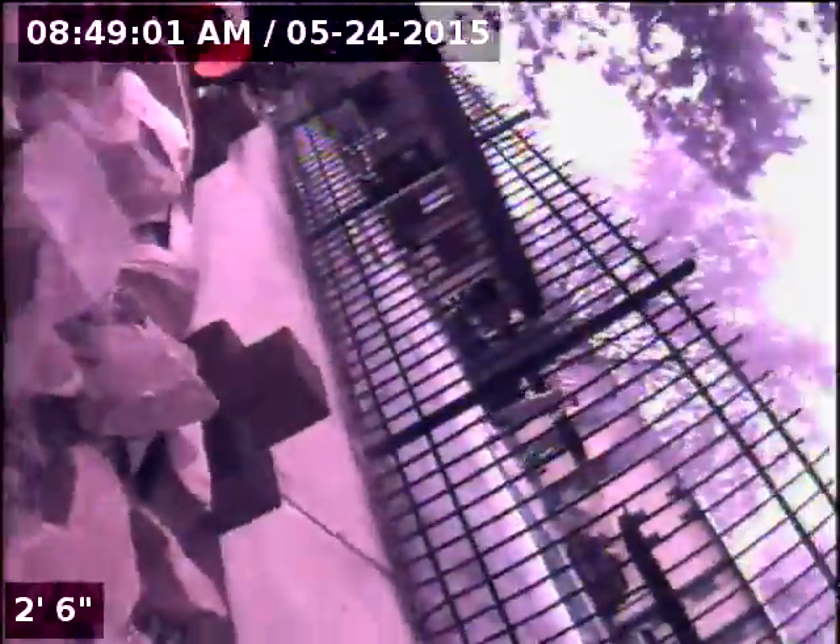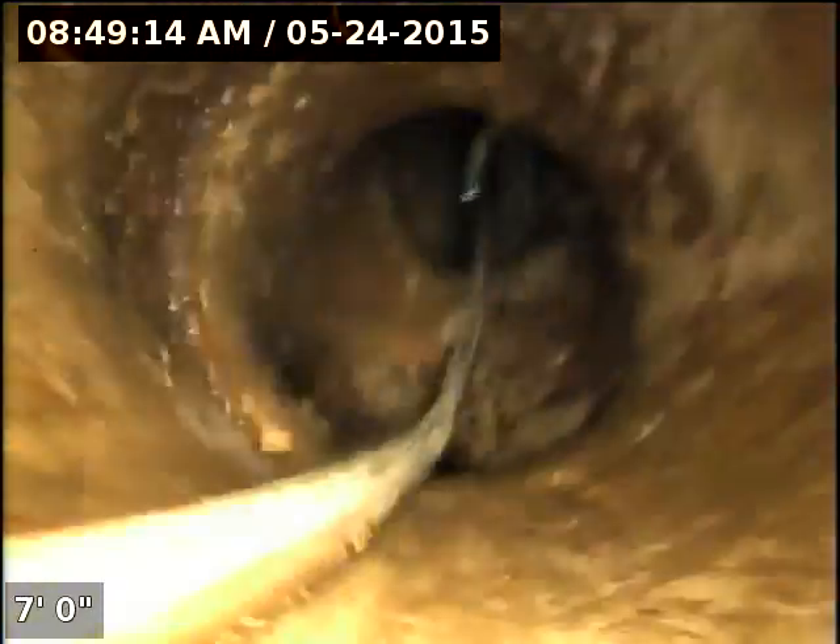I'm doing the recording for the outside clean out and then I'm done with the job — everything is good. I hydro jetted it, I'm going to show it now. Much better than before. I snaked it and hydro jetted it, so it's draining really good.